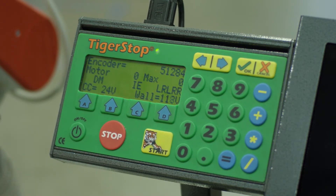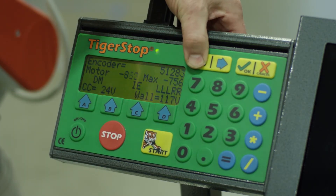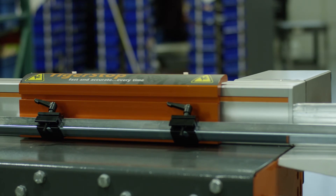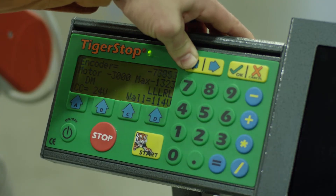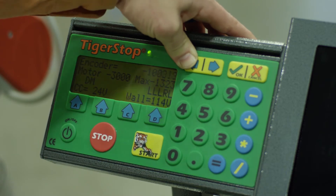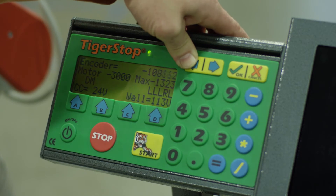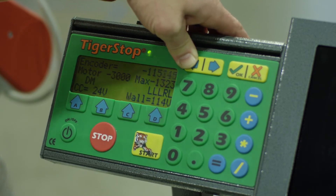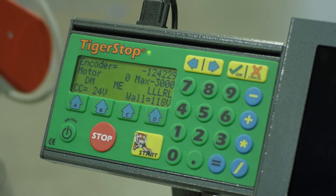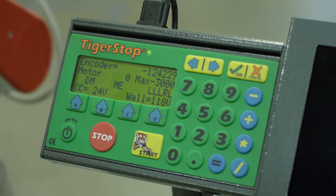We're moved all the way out towards the end and our IE is showing up. Now we're going to use the other arrow to get our negative motor reading and start counting down on the encoder. Once we get past the start point, we'll actually get a negative encoder reading as well. We're moving the carriage all the way in to read the motor end sensor. One thing you can look for while moving is belt binding — if you've flipped your carriage, it can actually move but it's much harder and you can feel it when pushing against the carriage. We're all the way in past our zero point now, and the motor end sensor has shown up on screen, meaning we're all the way in. Both end sensors are working and registering as they're supposed to.